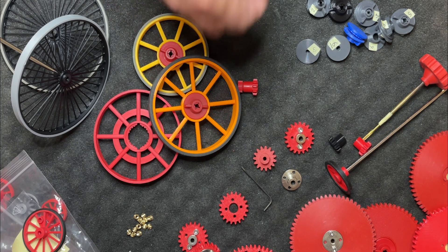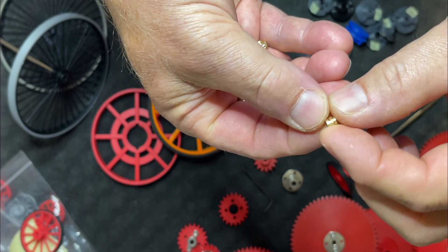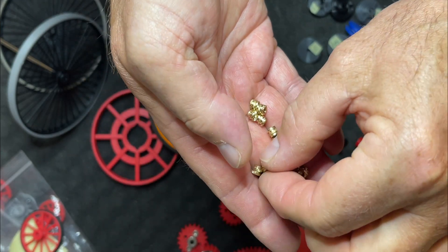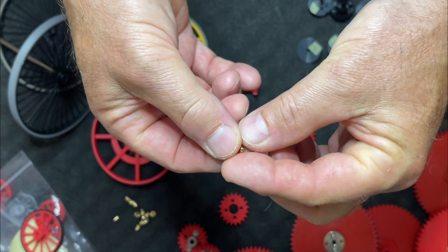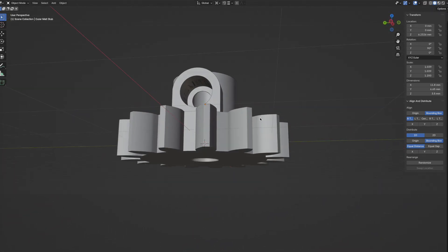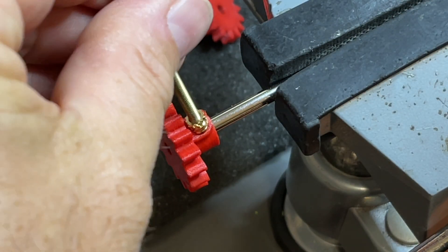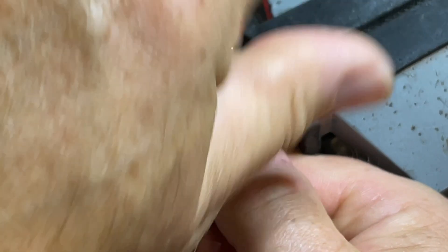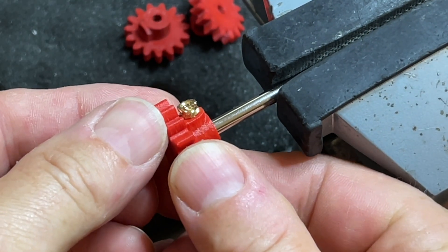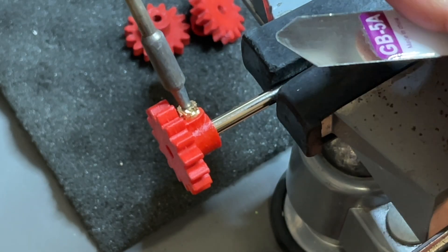While I was searching and puzzling, I thought of these well-known threaded copper inserts. After all, my main requirement is that for a good tight attachment to the axle, the screw must run in a metal thread instead of in the 3D printed PLA or PETG material — and of course these threaded inserts would fully meet that requirement. I decided to give it a try and added a small boss to the wheel to give it a little bit more material to melt the insert into. And to avoid the molten material flowing inside, I melt these inserts in with an axle already in the wheel, like this. Since the tip of my regular soldering iron never touches the plastic, I don't have a special tool for this — I know they exist and I'm curious to hear about your experiences with them, so let me know in the comments.